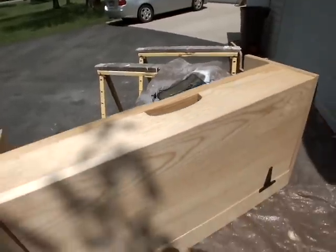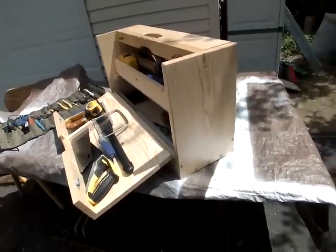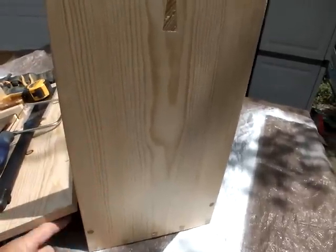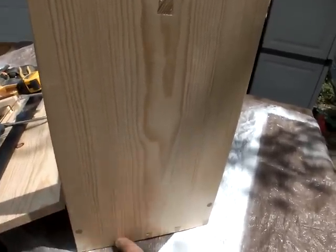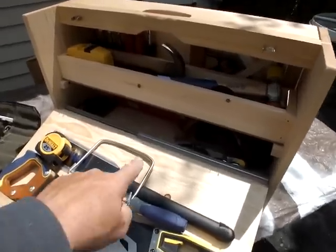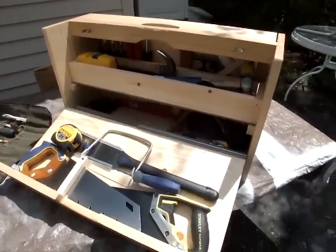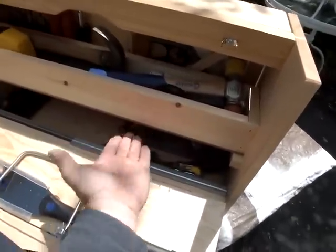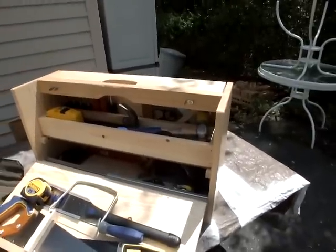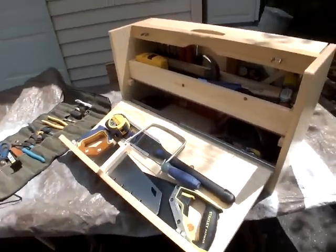This works pretty well. It's a good toolbox design and again credit goes to Jeremy Bruhn for his design. You might want to consider building this box — if nothing else, I think it impresses people to walk up with a wooden box. It has dovetails on the joinery down here, the bottom is solid pine with hand-cut through dovetails — the only kind I do. It is a solid bottom; there's a little till, all solid wood. The only exception is the bottom of the till which is masonite. Thanks for watching.